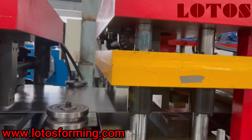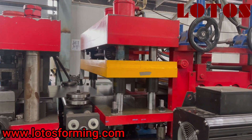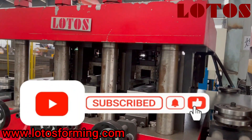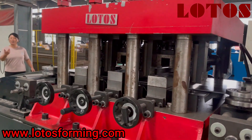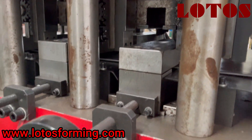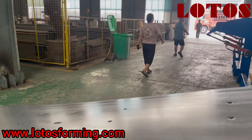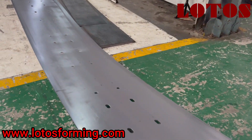Here is the hydraulic pre-cutting. When we need to change to another coil, we can cut it here. And here is the hydraulic punching station combined with 3 positions. We can adjust the whole position by this wheel to adapt different widths of the coil. Then it will come to the forming unit — we can check the holes we have punched at the station.